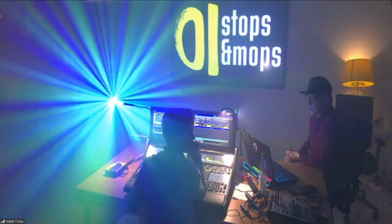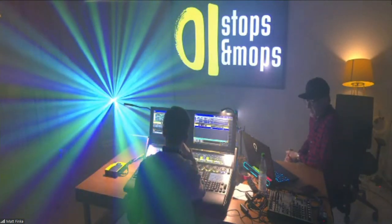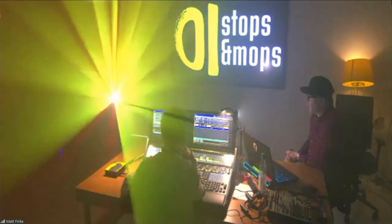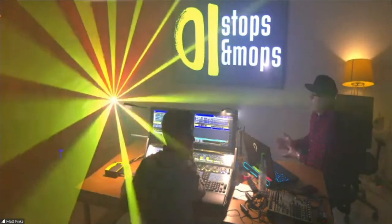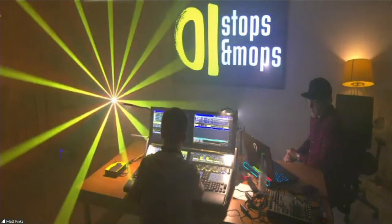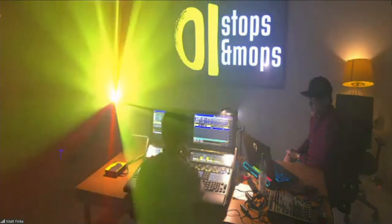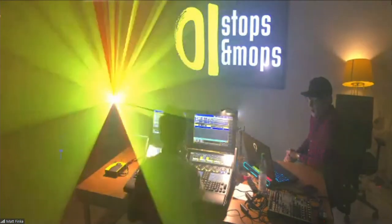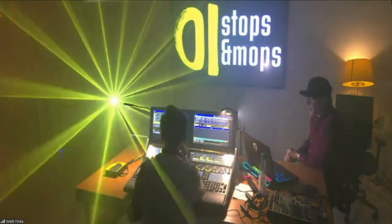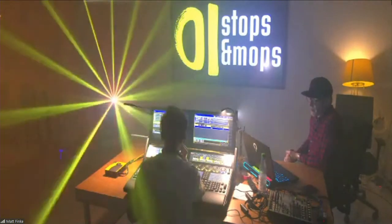If you're using a 30 or 40,000 lumen projector and you put an 8.0 lens inside an arena, that kills you. So for arena shows, to support a wide angle, it would be maybe a 1.4 or a 1.2 lens. If you've seen the video we created in Berlin called the Berlin Session, we were using a 1.4 to 1.6 lens on a 34,000 lumen projector, and that was flooding the whole venue. It was a long venue, and it was really, really bright.